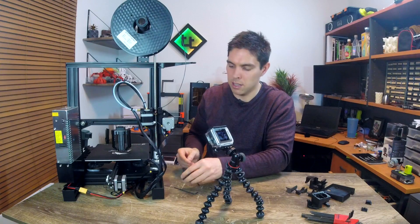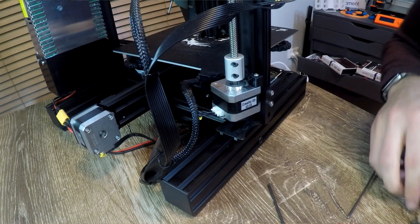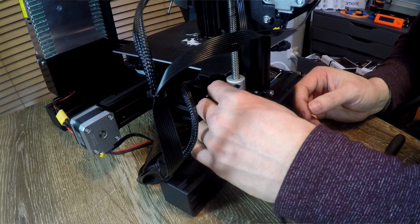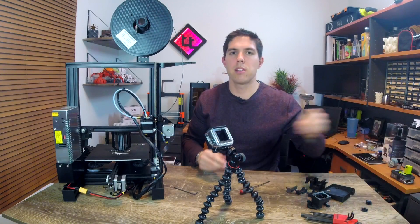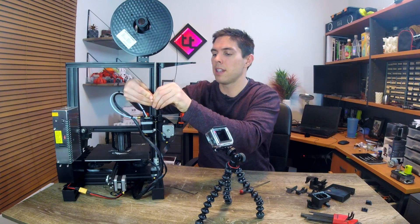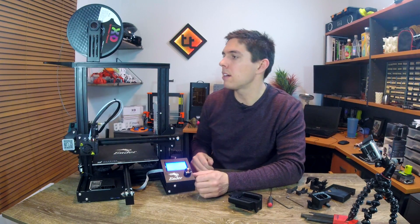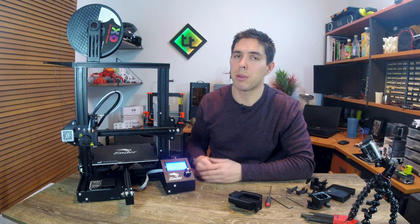Let's fit the first part — it has little ridges designed to fit in the extrusion. Clean it out and slide it in. The second part has the same ridges, and the cutouts need to face up to clear the bolts. Slide it underneath and bring the whole assembly back down; the hex bolts still line up. Tighten the ones I previously loosened, turn on the machine and try manually moving it up and down. It seems pretty good — very promising. The first time I had them tight it bound immediately, but now it appears fixed. Considering how quick these are to print, definitely worth a shot.